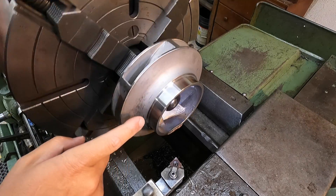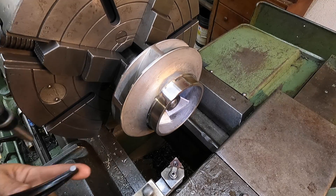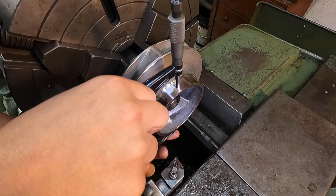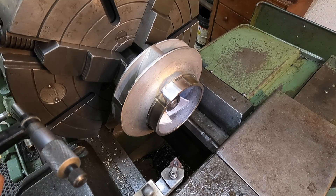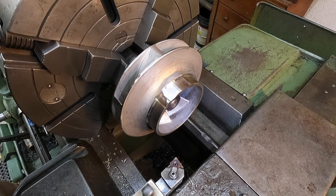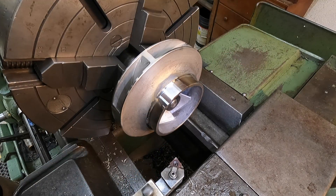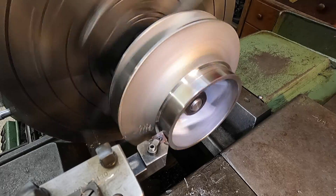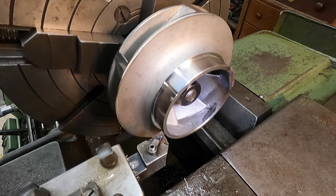There we have our buildup, and on the opposite side we're touching here too. I'm going to go ahead and mic it to see where this diameter is at, because I think we can bring it on down to match - or at least down to what we measured for this diameter of the seal ring. It's at 233 thousandths, so we can actually take another 13 thousandths off of this right here, and that'll bring these two high spots down close to match this point.